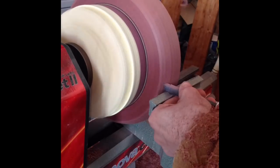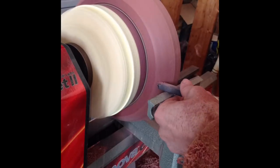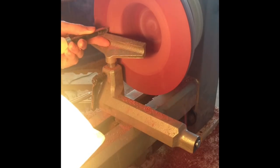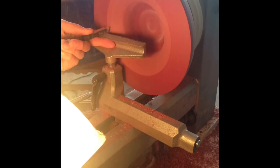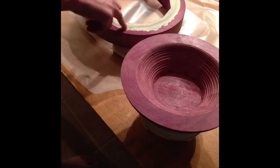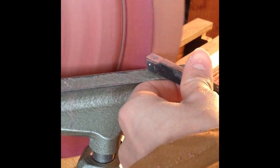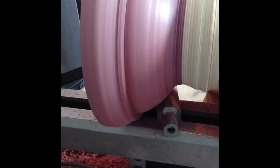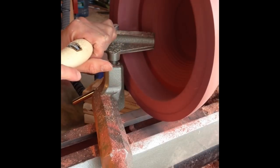I am giving each ring its general shape before putting on the next one. That way the lathe won't be too burdened with the heavy load and I am able to take off more material quicker. With the outside closer to its finished shape I can move on to the inside, using the same technique with the square carbide cutter. Now I was getting cold in the shop so I had to move my gluing inside and I'm using a different method - I would balance a piece of wood on the faceplate and then clamp it to the ring. Now I can true that ring up again. I got it pretty centered but it was a little off, so I'm just doing that now, then bringing it down to the closer shape that I want.